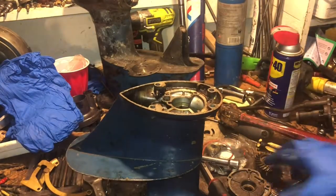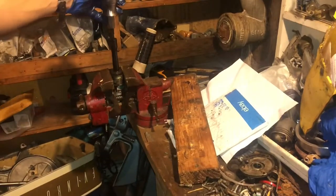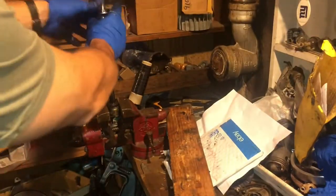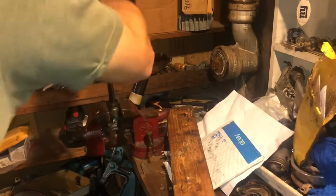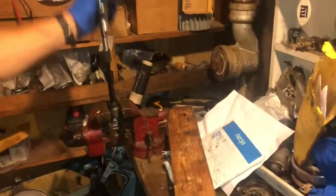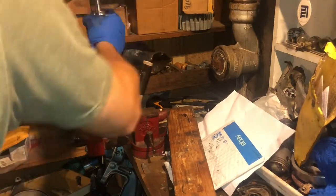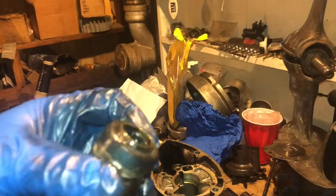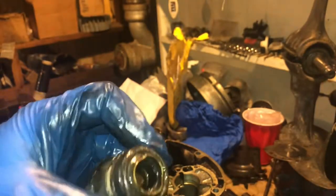Next we can do the plate. I found a way to use the slide hammer — you stick the puller in there and slide hammer it out, stick it in the vise where it grips. Kind of tedious and annoying, but it seems to be working. The reason the seal puller doesn't work is that it blows past the outer ring of the seal rather than gripping it. We'll get it out.